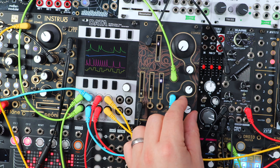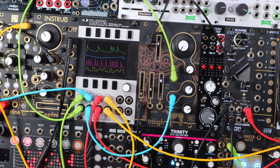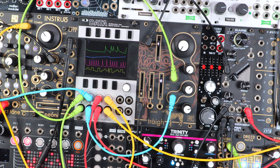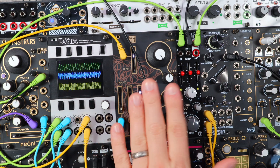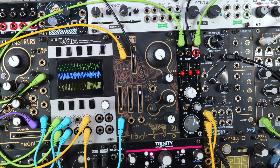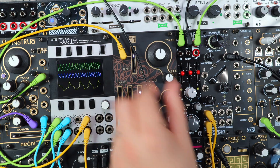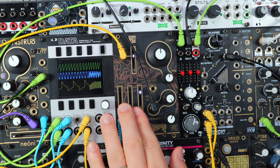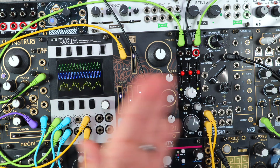Quite a lot of resonance. So a single oscillator, a single pulse, and two layers. Here's a fun patch for sub-octave generators. While I'm doing this on Tri, you could use other sub generators or even clock dividers to achieve similar results — the advantage here being we can filter, animate, and mix this with the subs and the input.